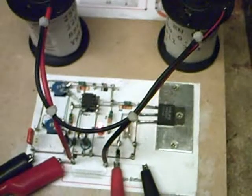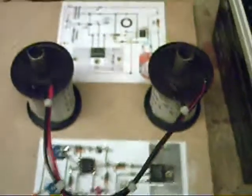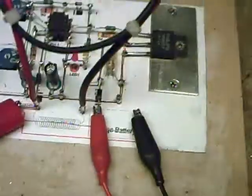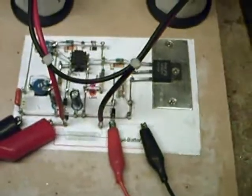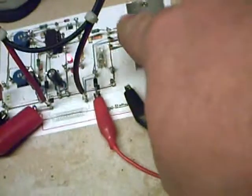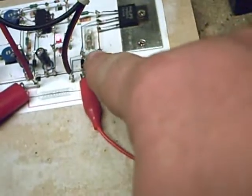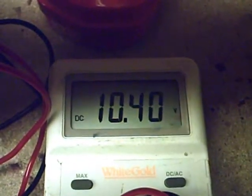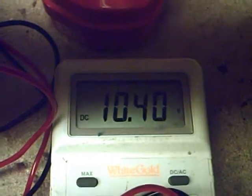I've got the idea from people that are using relays - so if you'd imagine those two are like relay coils being triggered with a triple five timer, collecting the back EMF in the same way as you would with a Bedini circuit. We'll just put the leads back on the battery and see if the voltage has gone up at all. It's gone up a little bit - this battery was down as you saw at the beginning, and it is climbing, so it's obviously working.